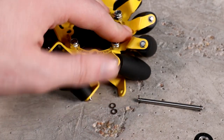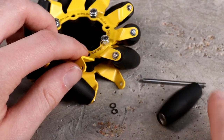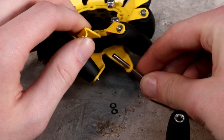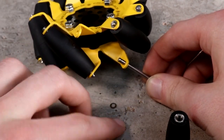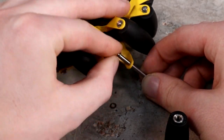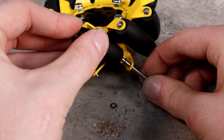When you're ready to put it back together, pull your plates and your core together to get your sandwich, and start putting your rollers back in. Grab the shaft and insert it into the hole like so. Then grab one of your shims and install it on the shaft just like that. Be careful not to get that shim stuck on the e-clip ring that you can see there.